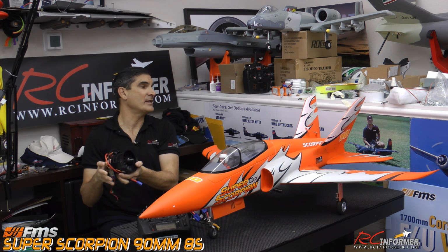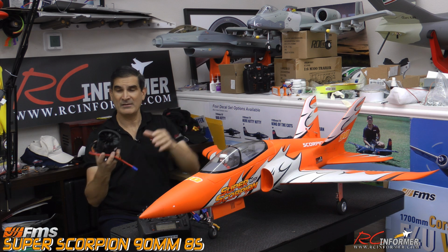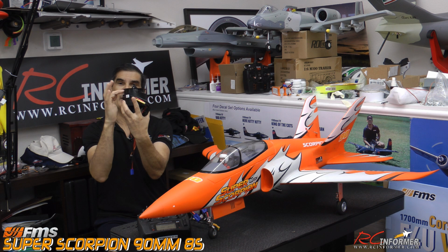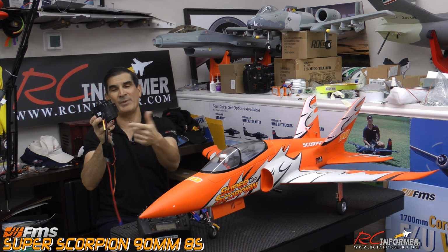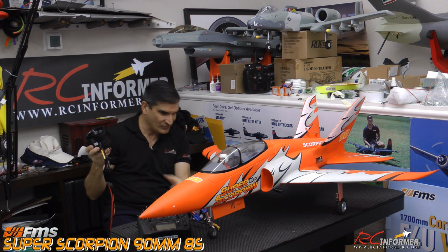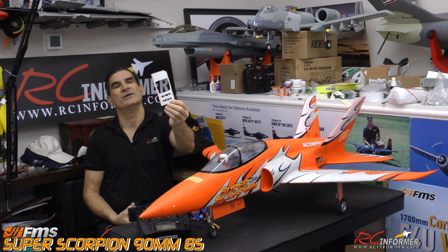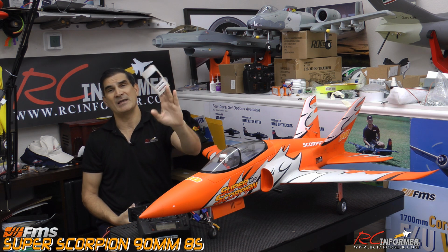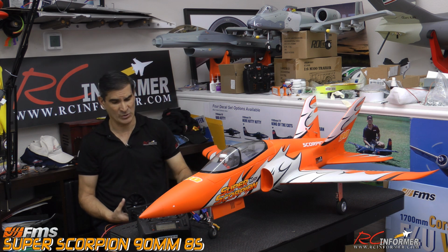But really all we had to do was, as you can see, just pull the old one out and put the new fan in. There was a little bit of adjustment that I had to make to the foam lip area in the airplane, and then this thing drops right in. Even the bolt pattern is the same. Again, my little plastic piece for my retainer, which is made out of Lexan or whatever, for the ESC. I just made my own because it made more sense to get one that fit that speed controller, because that speed controller is a little bit smaller.